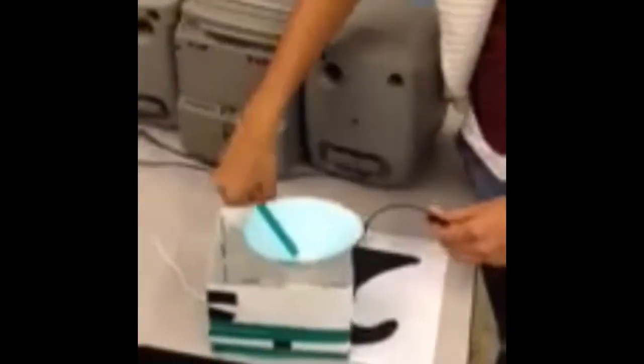Okay. When everything is done, you can take 2 pieces of bare wire, or just sand off both ends of the wire, or burn it, and you can stick them in the terminals of the radio and close it. And you can do the other one. Make sure one is in red, one is in black. You'll need 2 pieces, and then you plug one alligator clip to one wire and the other to this end, and then your speaker will work.